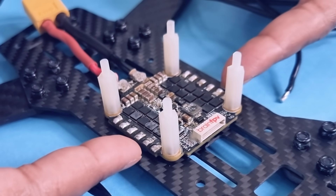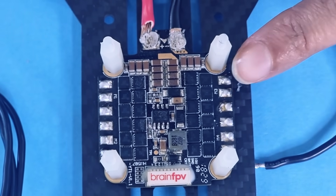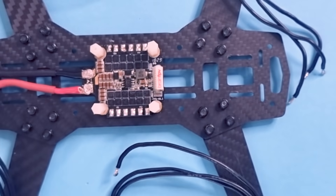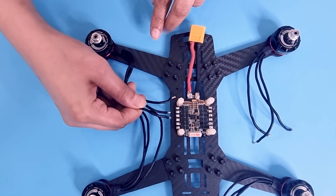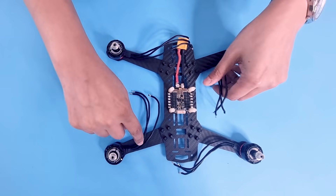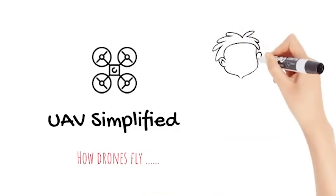Now comes the most complicated part, so pay attention. We will now connect the motors to the ESC. If you look closely at the Hobbywing 4-in-1 ESC, you can see that the connections for the four motors are clearly marked as M1, M2, M3, and M4. These positions correspond to the motor numbers in the INAV firmware, which we will be using to configure our drone. Our motors have three wires and the ESC has three soldering pads for each motor. For motors 1 and 4, carefully solder the three wires from the motors to the three soldering pads on the ESC — do not cross the wires, to ensure the motor rotates clockwise. For motors 2 and 3, carefully cross any two wires and solder them to the ESC; this will change the direction of the motors to counterclockwise. If you want to know why motors need to rotate in opposite directions, please see our video 'How Drones Fly,' where we have explained the science.